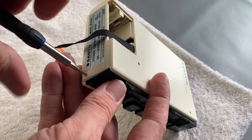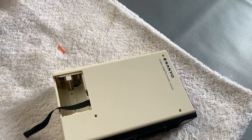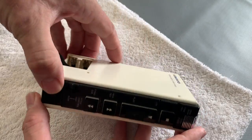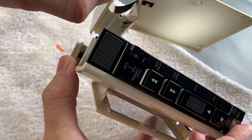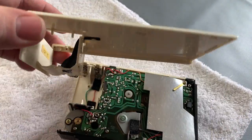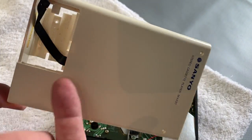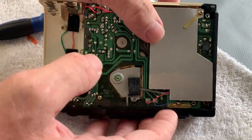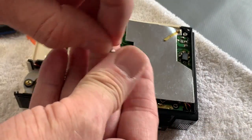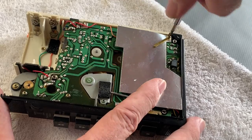We change the head bit for the tiny screw. Once those four are away, much like the triple three zero, it's just then a case of peeling the casing and housing away. The back case slides out - there's nothing on there, no radio on this, all we've got is the battery ribbon attached to the back. That brings us to the inside. I'll just remove the pin which slides in there for the strap so we don't lose that.